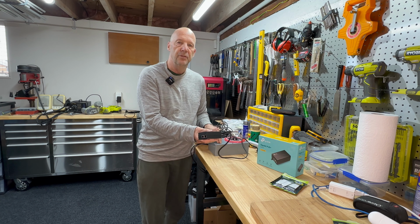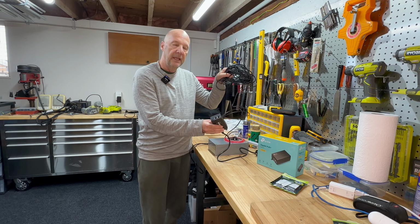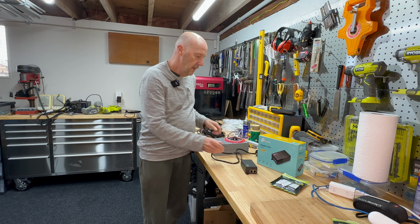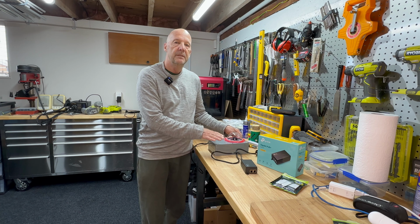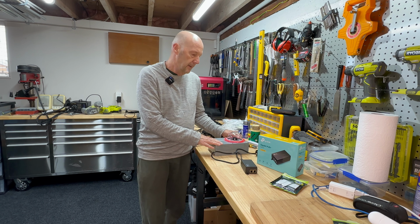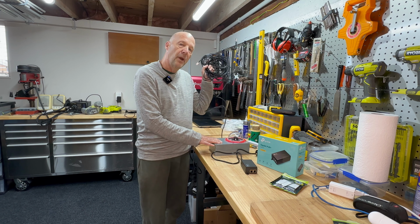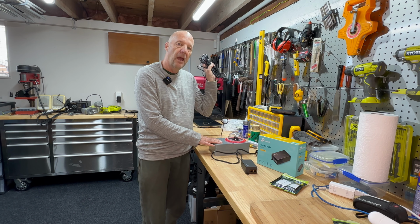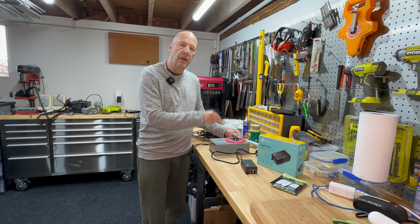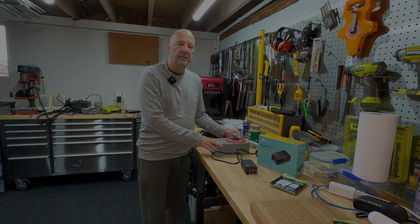I'm not doing it at the moment because I'm just using the wireless directly off this, so I'm just plugging this into power. I've got this Ethernet cable just plugged into this port over here, and it all seemed to run fine. The PoE plus Pi Hat was around about 45 New Zealand dollars again, so on Amazon you'd probably find it around $22. So not that expensive, and it just means that I can now give it all the power I want from quite a distance away. I understand that you'll get power over Ethernet for up to 100 meters, so that's pretty good distance. So let's just quickly open up and have a look inside, and I'll show you what the connection is and where the PoE plus Pi Hat is sitting.